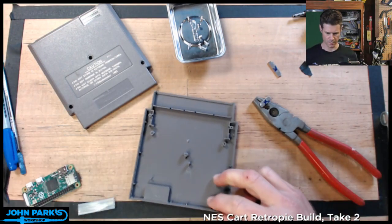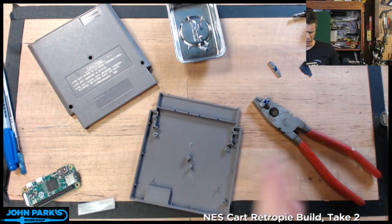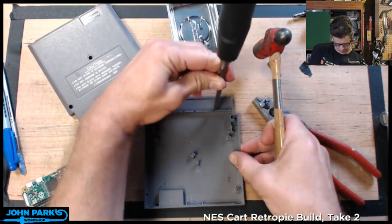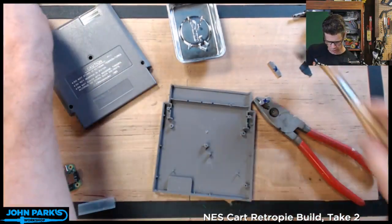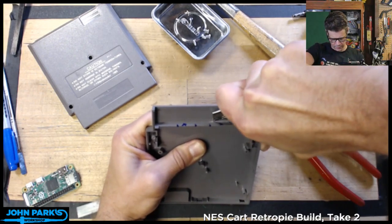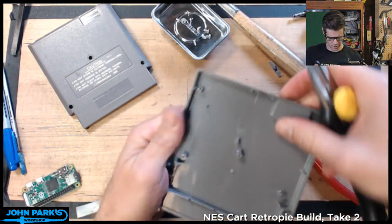And you know what, just for fun, since I mentioned it, I'll show you how I was doing it with the chisel. Grab a hammer of some kind. It's a little bit of an overkill, and there's a slight danger of breaking off more than you want, but what the heck. Here we go. I just aligned this flat side on the inside. Oh, I should score this first, sorry. If I score it first, that gives the stress a preferred place to go, that's where we want, so you're less likely to break off parts that you want to keep.